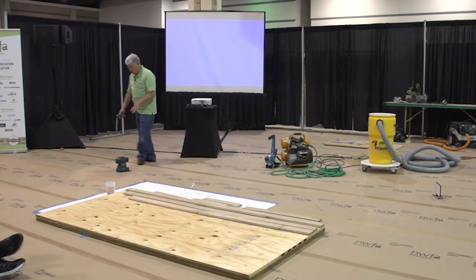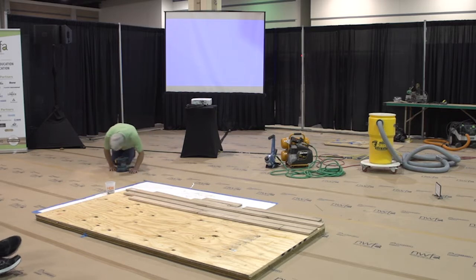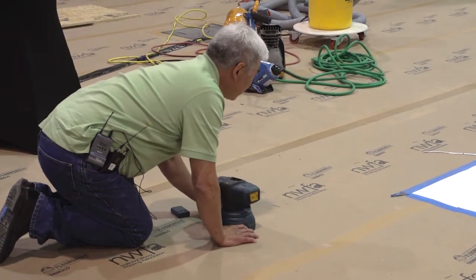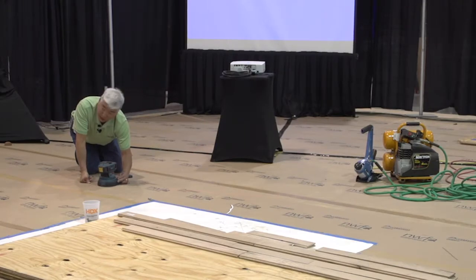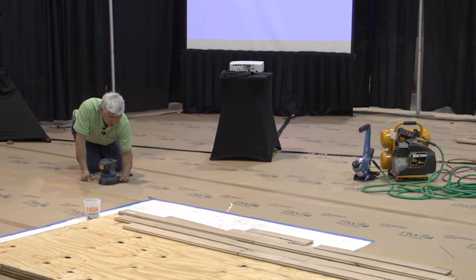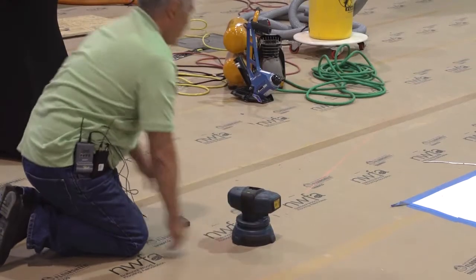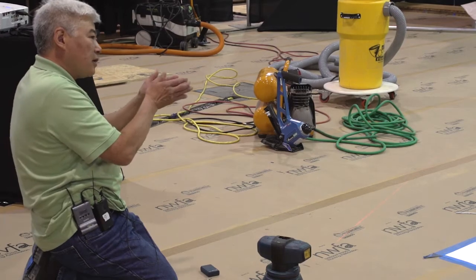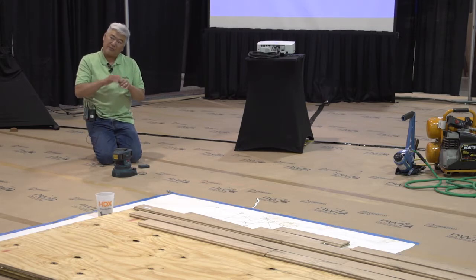So this tool here — I'm going to go ahead and demonstrate this. It basically has two lasers that shoot out. There are two beams right there. You dial in to where you have one continuous beam, and that's your reference point. Now, anywhere this beam splits — you can see it shooting across the floor — you can see that beam separating, coming back together, separating. Anywhere that beam splits, there's an undulation. It's either going to be high or it's going to be low.